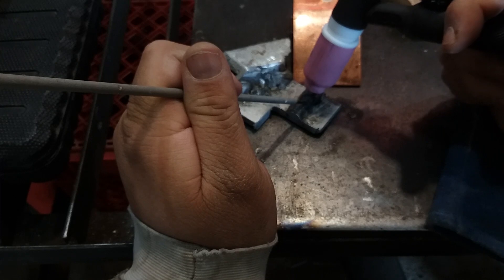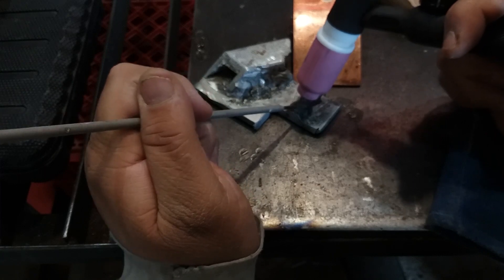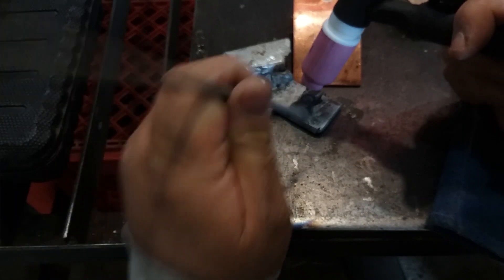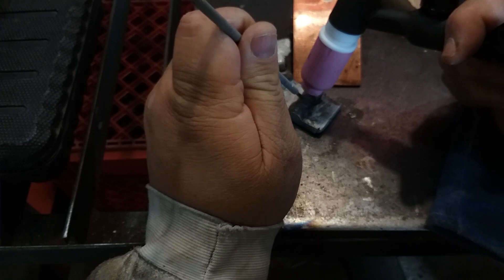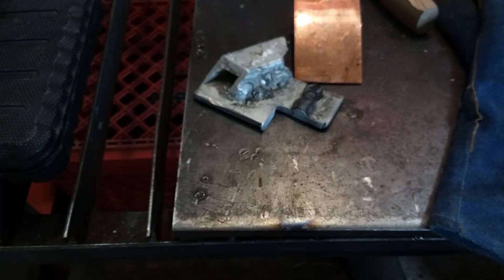You'll see a little skim — it's not like AC where the weld gets really shiny. As the skim bubbles up I go upwards, then move forward, and do the same thing again and again. With this type of process you have to stab the filler in there — it's not like regular steel welding. It does use quite a bit of filler, but practice makes perfect and everyone will have different results. It can be done — I've proven it.